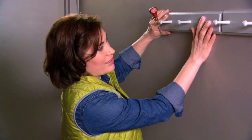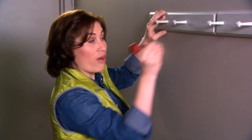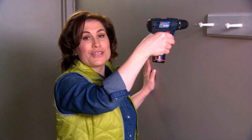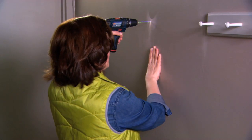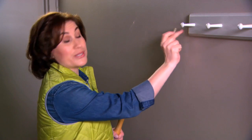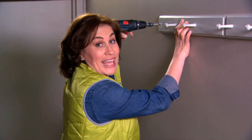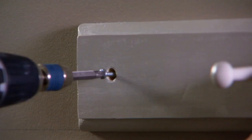Place your peg racks along a line to make sure that they're level, and with an awl mark the wall where you need to hang your screw. Drill out the hole. Get the anchor that's appropriate for your wall type — these are multi-use but they're very good for drywall, which is what our wall is made out of. If you set your screw in the peg rack before you start screwing it to the wall, it will hold it in place for you.